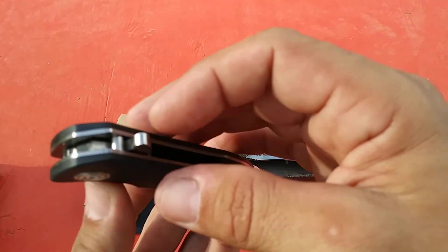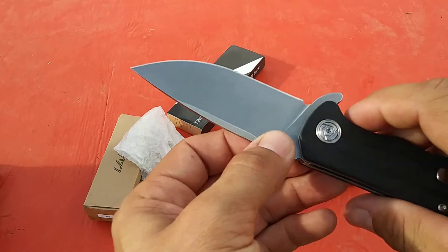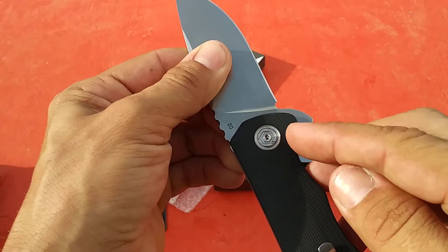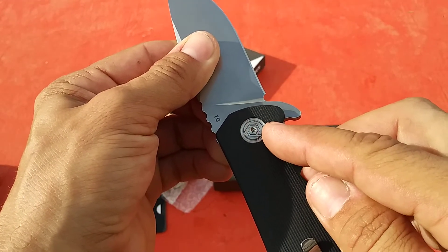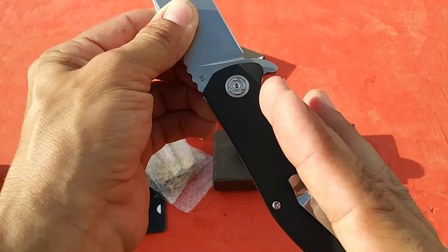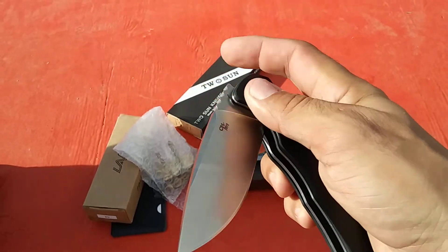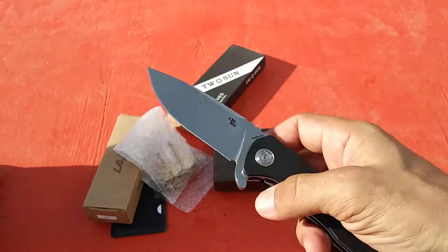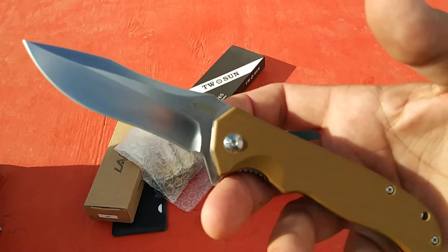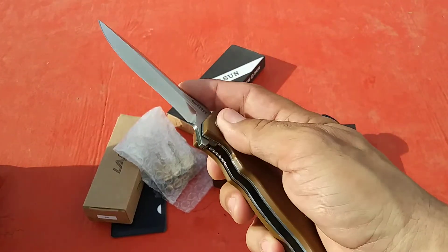I have a diamond rod — kind of a tapered diamond rod that I use. All you have to do is take the knife apart, put some tape on the blade to keep from cutting yourself, clamp it down, and then just look and see where the track is for that detent ball. Right where the track ends at the lock face, just take that diamond rod and start slowly cutting a groove right there. Being a tapered diamond rod, you can make a triangular groove. It just makes a big difference being able to close the thing. Pretty simple to do, and I was happy with it overall. Made for a nice comfortable modification, and I think this one will be really nice after doing that one as well. Minor change, but helpful.